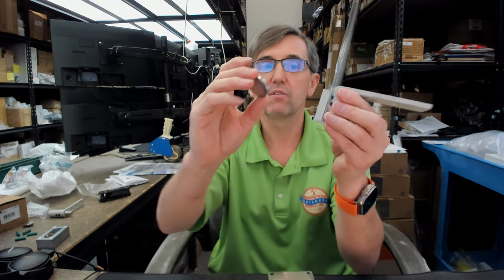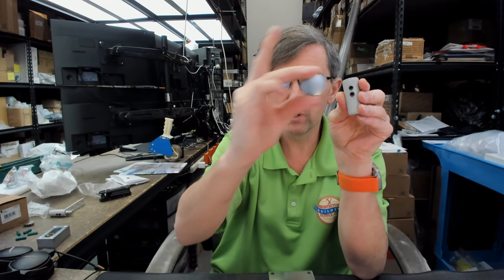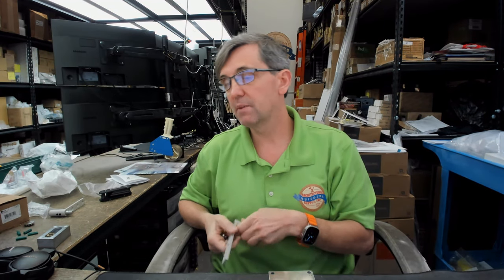They don't have any clear direction as to how you do that. And you might be thinking, well, how do I get to the set screws? Well, that's where those snap covers come in. You're going to drill a hole in the edge of the door, and you're going to cover it like that. So you will see these buttons every time that the door is operated, depending on the swing. If it's reverse bevel, you'll never see the buttons from the pull side. If they're in swing, you'll see it every time you open the door.